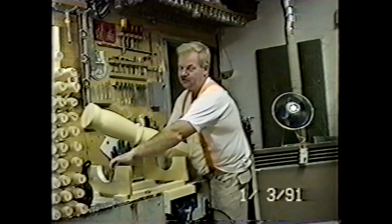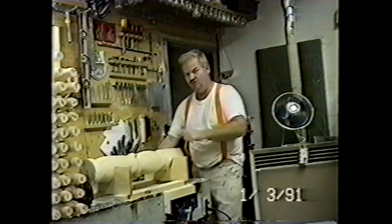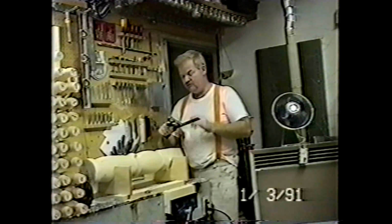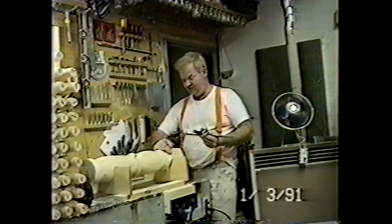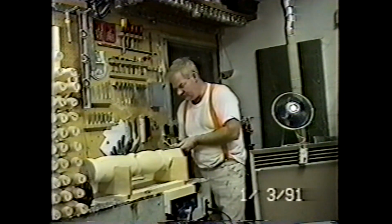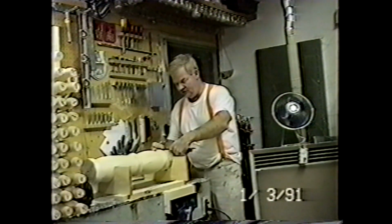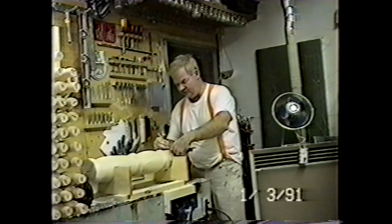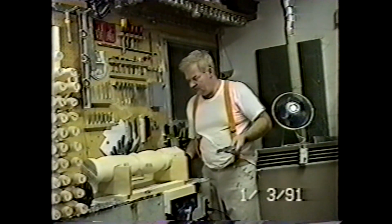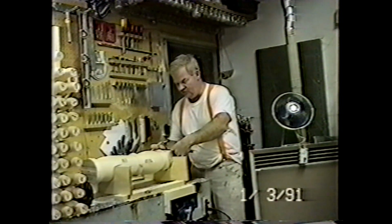Now the thing is, fasten the legs to the table. Every second one. I got 6 sides, 3 legs. Every second one's going to get a leg. Scratch a little line in the center of this here, on every second one. Mark the centers. A line about 1 inch long, about 3 or 4 inches up. You'll see why in a minute.